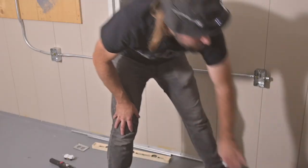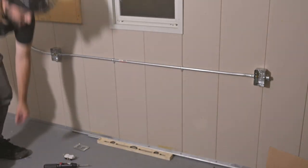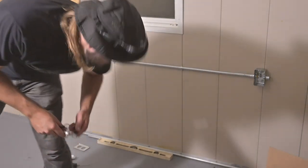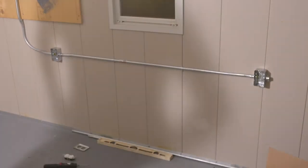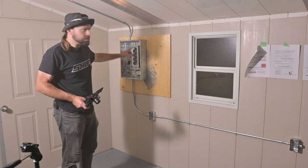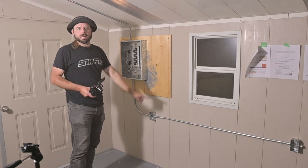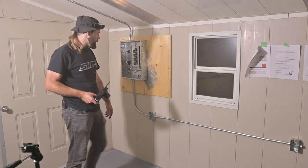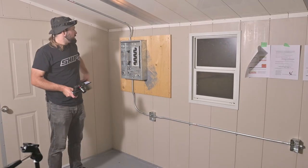That looks good. I'll put some straps up, and then finally we grab our little specialty tool and our pair of pliers, and we'll snug up those lock nuts. Now, if you look at this corner, it's a bit sloppy looking. Truth be told, this is the first piece of conduit I tried to cut to do this guy — I botched it up royally, but I was able to salvage it and straighten it out and get some nice box offsets. So now, ta-da, it's going to come down there, it's going to go over there, and that's two receptacles. I have plans to add three more spanning the shed, but I think that's enough for tonight.